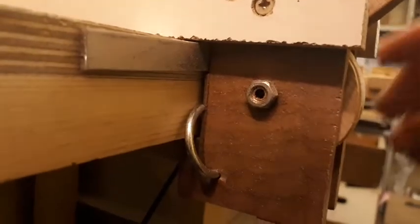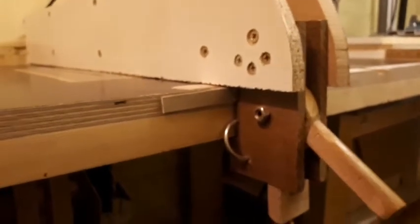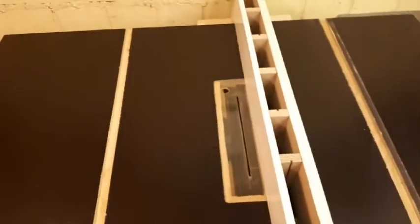Can one see that? Probably not, but you get the idea. It's basically a circle with an off-center hole. As you push it down, it goes closer and closer to the table, pushes the fence away — you can see there's a little gap here — and clamps it against here. And then I have a construction at the bottom which clamps it to the underside right here. That makes sure that it's pretty tight and very precise.